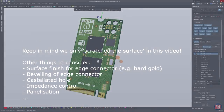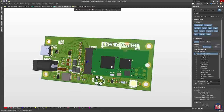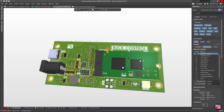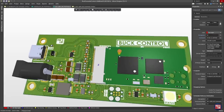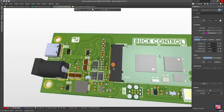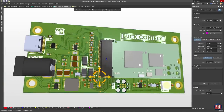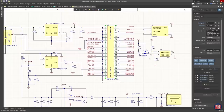I hope this gave you a good initial overview of this PCB design. We'll be using this PCB in future videos where we need a generic microcontroller, some flash memory, or some RAM, and we don't want to keep redesigning the same system. For example, I designed a buck converter control PCB that uses this little brain module for digital feedback control of a buck converter — quite an interesting project we'll look at in a future video. In this way, I just place down a card edge connector, plug my little brain in, screw it down, and design my carrier board pinout from there.